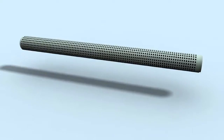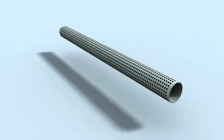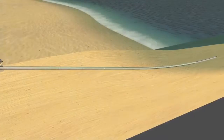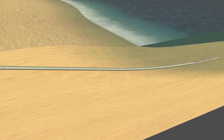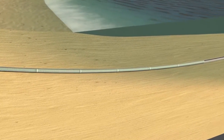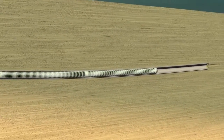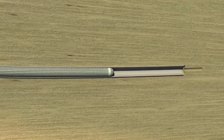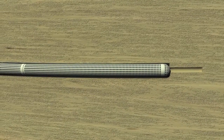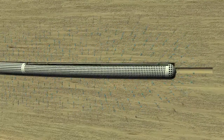The microporous HDPE is lightweight, durable and flexible with a high bend radius, making it the ideal product for this application. Operationally, using subsea intakes provides much higher quality feed water. The virtual lack of turbidity means low silt density and greatly reduced levels of total suspended solids and total organic carbon. There is also a built-in natural filtration process that virtually eliminates microorganisms prior to filtering into the pipeline.